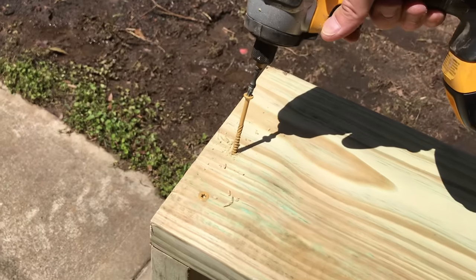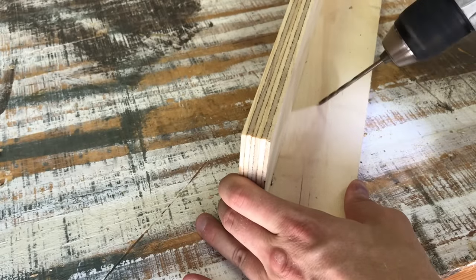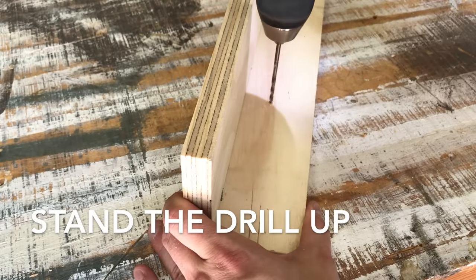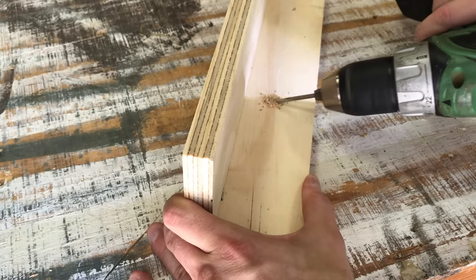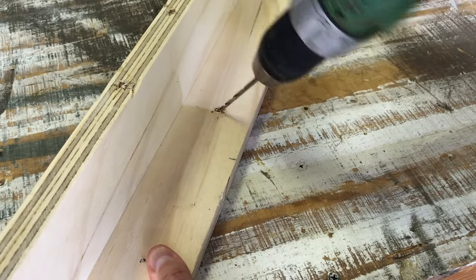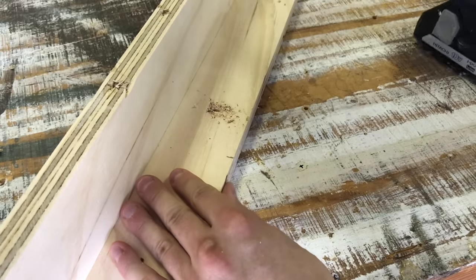Tip number ten: toenail drilling. Toenailing is just driving a fastener at an angle, but drilling at an angle can be tricky because the drill bit wants to wander around. Start by standing the tool up and drilling vertically at first — this lets the drill bit bite into the material and get set. When the tip is just slightly embedded, you can now tilt the tool down and drive at an angle. You can carry out this tilt either when the drill is running or when it's at a stop, but make sure you don't break your bit if it's already too deep. I usually keep the drill running so it can cut its new channel by adjustment.